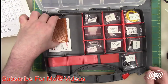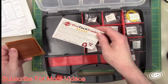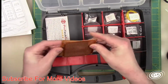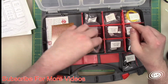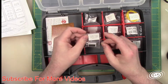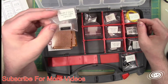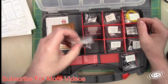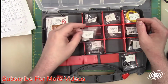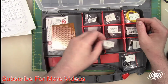So we have two PCBs here and a thank you card. Two PCBs for doing some soldering. We have a 74HC00, which is a quad 2-input NAND gate. I have a series on logic on my channel. You can check out about logic gates. We have another quad 2-input AND gate, 74HC08.